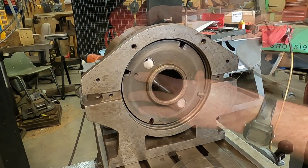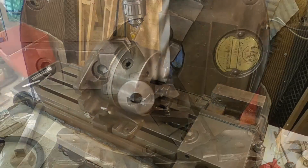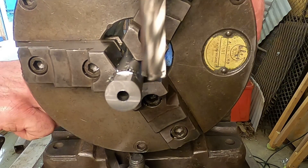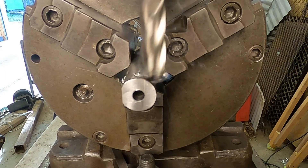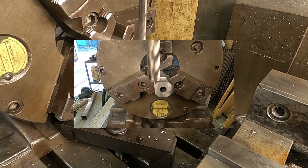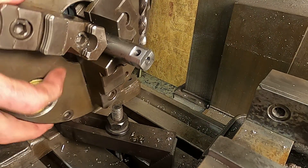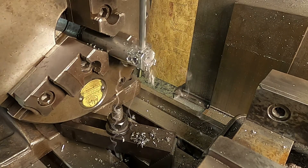The plate with four notches allows me to quickly and accurately position and lock the chuck in 90-degree intervals. With four small flats cut to the end of the part, I drill a quarter-inch hole for mounting the indicator. Then I rotate the part 90 degrees to drill and tap a hole with a quarter-28 thread. This will be for a set screw to lock the indicator in position.